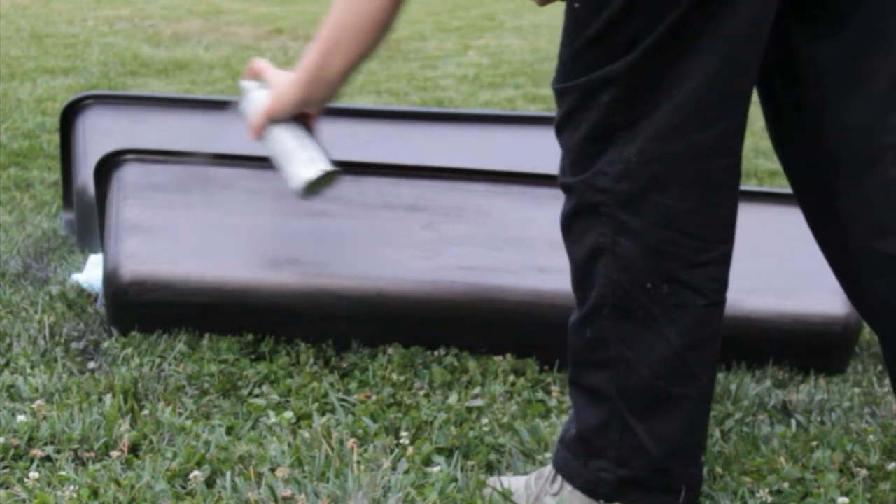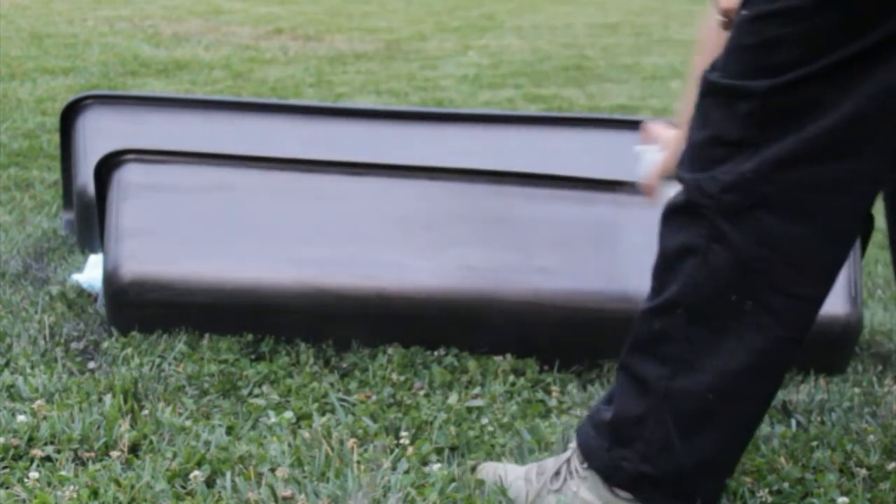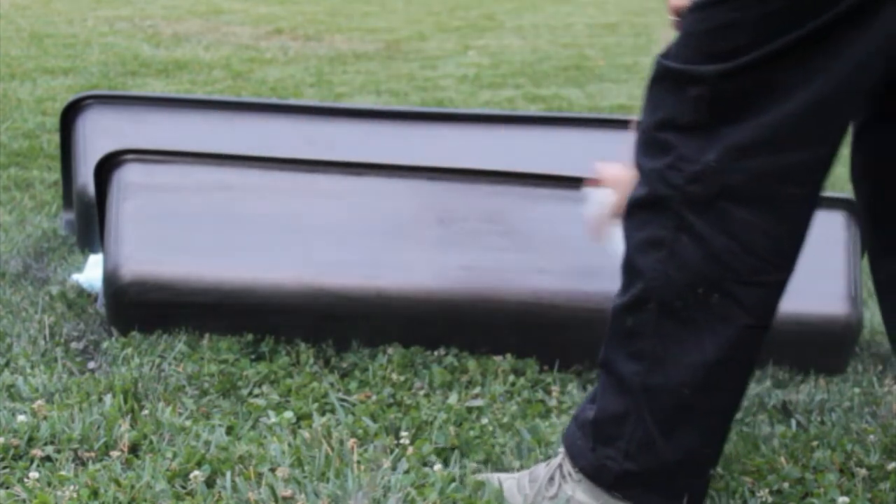Continue using this painting process until you finish coating the entire bottom, the sides, and the front side. You don't have to worry about painting the back side of the box or the inside, because you'll never see those — the inside is full of dirt and plants, and the back side is against the wall. Save paint and don't worry about those. Once you let it sit for about 10 minutes — or just touch it to see if it's tacky — flip it right side up and paint that top lip that goes around the top of the window box. Then it's done and painted; make sure everything is nicely and evenly coated, and let it dry.